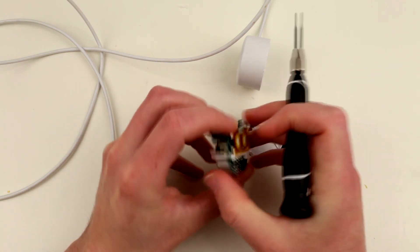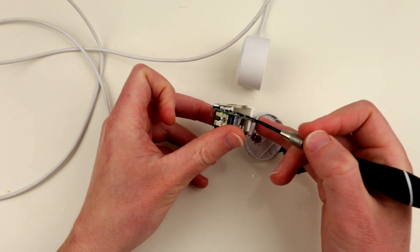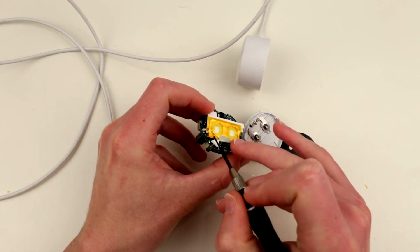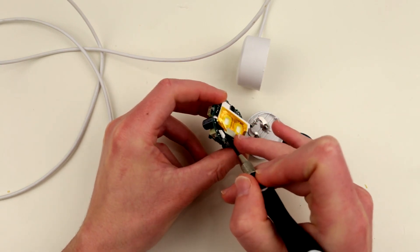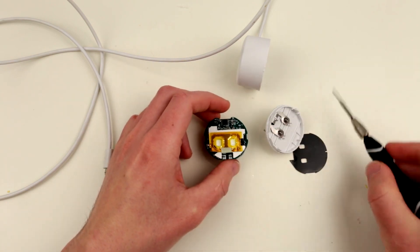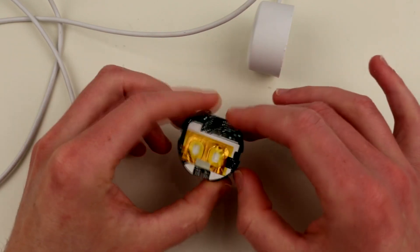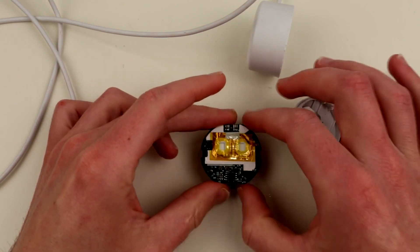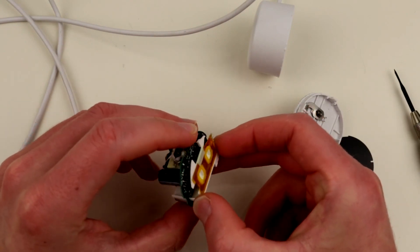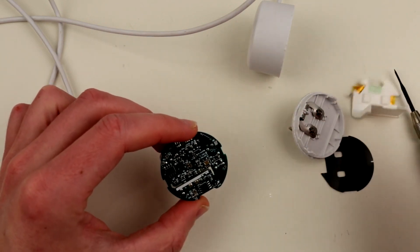It's a whole assembly like that — there's a cutout and everything. In order to see what's underneath, I have to unsolder this part. From first glance I can see some chips here, a few diodes down there, and what looks like a bridge rectifier. Let me zoom in a bit more and see. I'll unsolder it quickly — I'll be back. Okay, it's desoldered, let me pull it out.